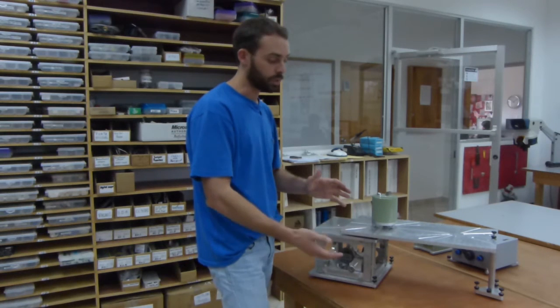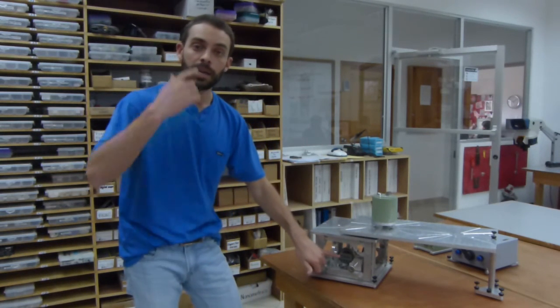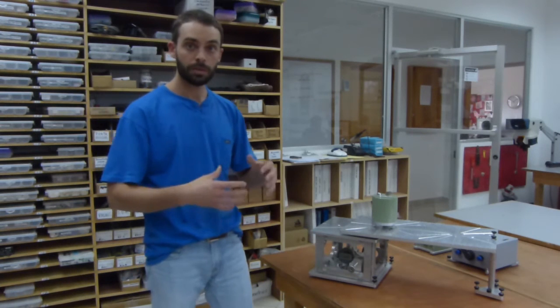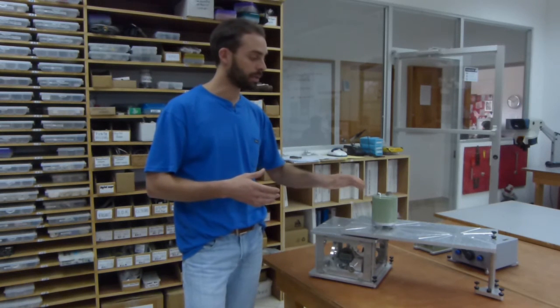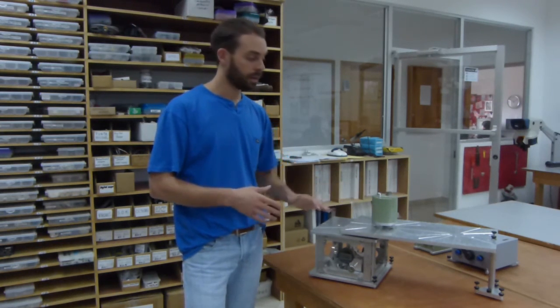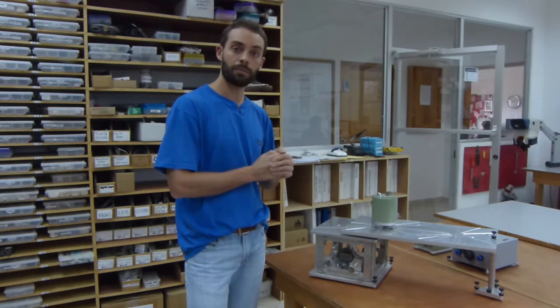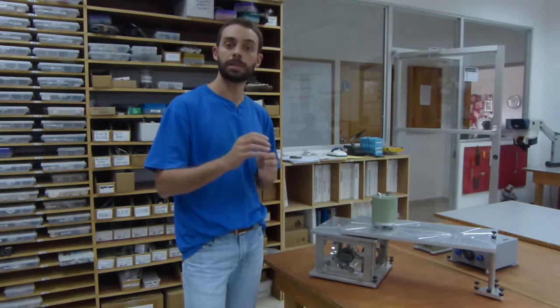During that process, when you're going up and down, you want to be looking at the dial and remembering what the maximum displacement was. That maximum displacement will be an input parameter into the OSOP Cal program that will allow you to determine the gain for the motion that you saw. Now, because we're working in a horizontal, we recommend calibrating at a very low level in the butterfly. Use the minimum displacement possible.